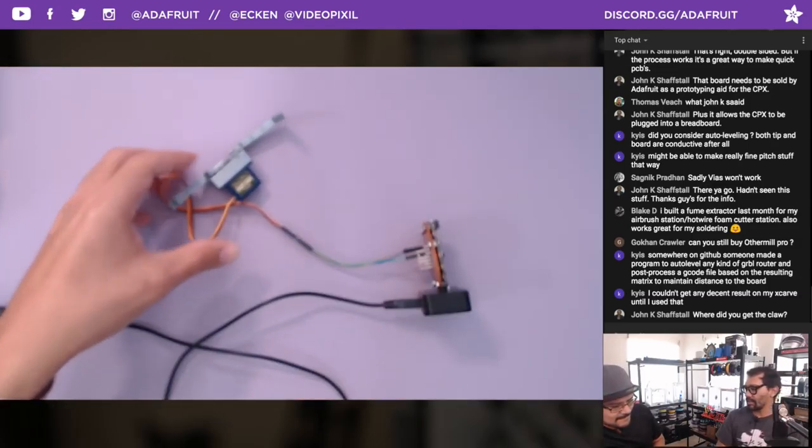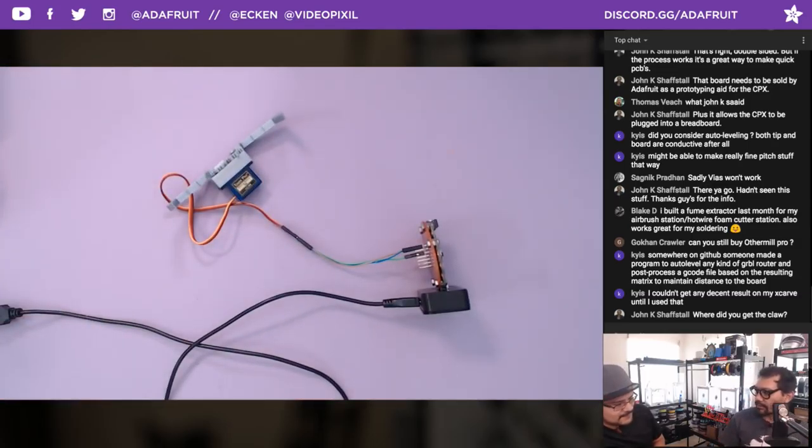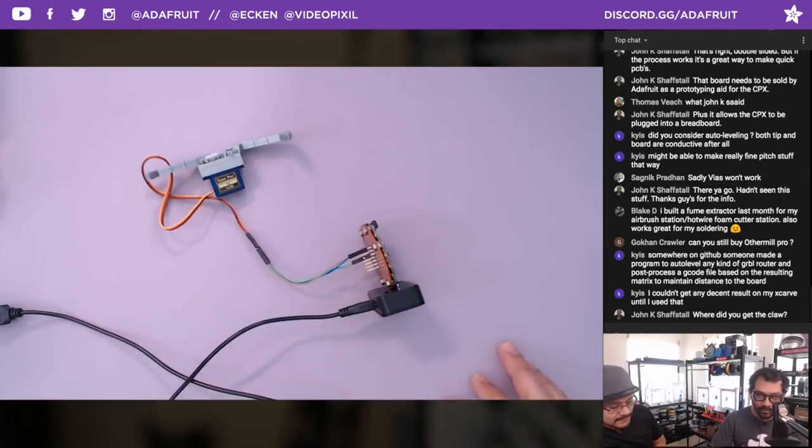Yeah, so they did a really good job of getting all of that simplified when importing all of your PCBs, your Gerber files. It does a really good job. All your settings are tuned and optimized for precise milling. And you do some really detailed milling stuff. Yeah, again, 6 mil traces with 6 mil spacing. That's crazy. Yeah, pretty cool. So I'll probably put a guide together on how that process works. Yeah, that'll be fun. Cool.